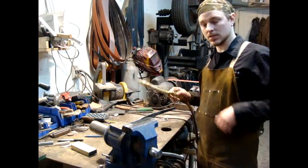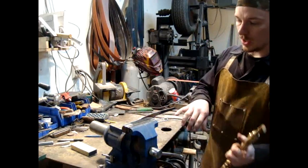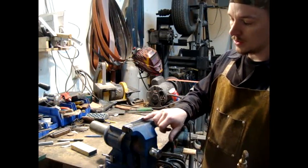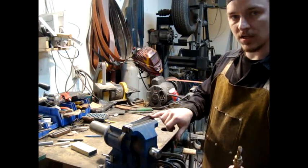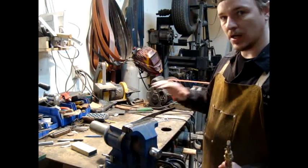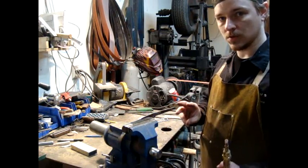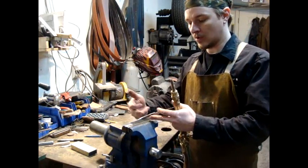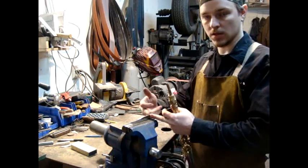I'm going to be doing that with an oxyacetylene torch, heating it just to where it starts turning to a purple color, just along the back of the knife, and then let it air cool. I'm going to do that three times so I know the pearlite formed all the way through to the center of the thick part of the knife.